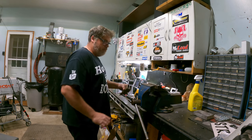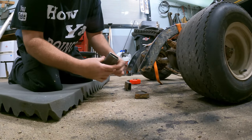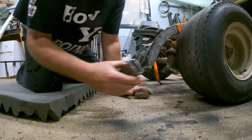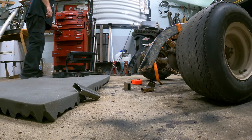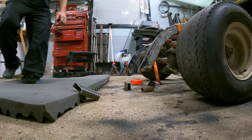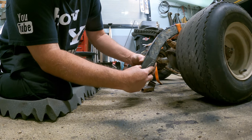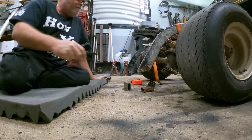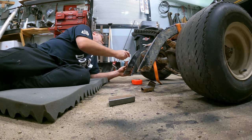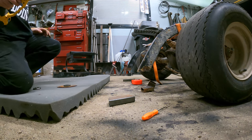How are those sparks looking in 4K? All right, there are my two pieces of frame extensions. Now we've got to make sure we cut this straight across. So we're going to mark it again — I lost every single one of my doodads. We'll line that up to there, scratch-mark it, and then we'll do the same on this side. Now we get a grinder and we'll cut that off.